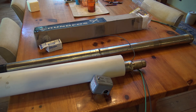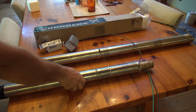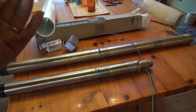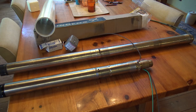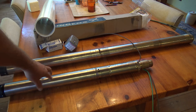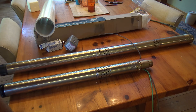Enough of me blabbering away about pumps. Both of these pumps actually run great off small inverter generators like the Honda EU2000i or the Yamaha, or even the Harbor Freight Predator inverter generators — they run no problem. And on the bigger pump, the SQ Flex, it'll run 115 or 230 volt — it doesn't care what you throw at it. That's the beauty of the beast: 90 to 265 volts AC, 30 to 300 volts DC — that's your range. The thing just seemingly pumps five gallons a minute no matter what you throw at it.